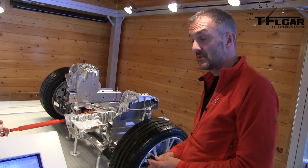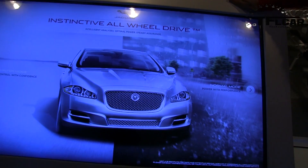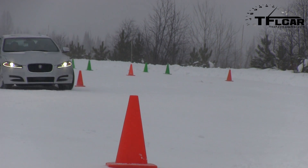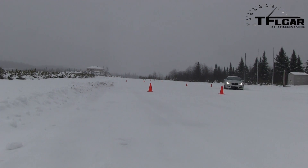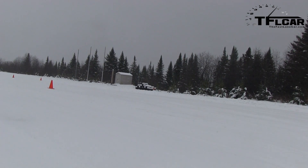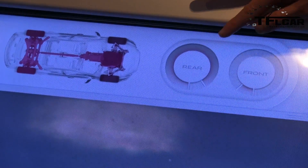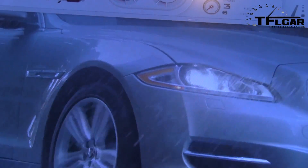That's the mechanical layout of the underbody. Moving on to the control strategy, this graphic will play two films. The first is the car operating in normal mode, and the second in winter mode — you can have the car in normal, dynamic, or winter. In normal mode, this shows an XJ driving on a wet road — not very icy, but with some chance of wheel slip. From a standing start, we automatically apply 10% of the drive to the front wheels and 90% to the rear wheels.